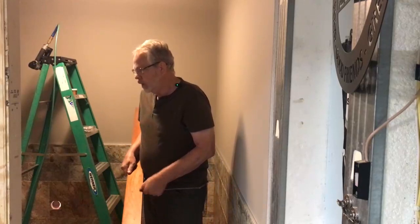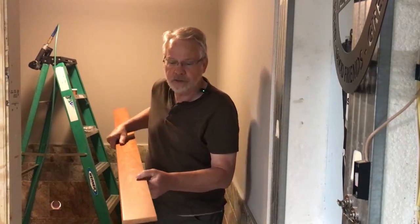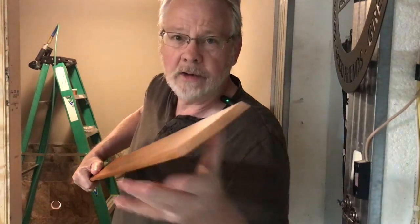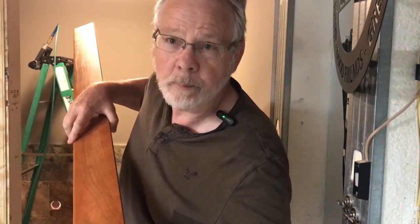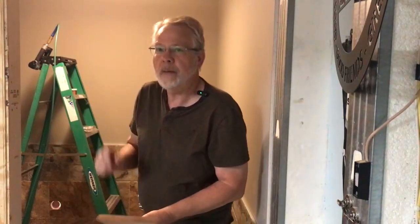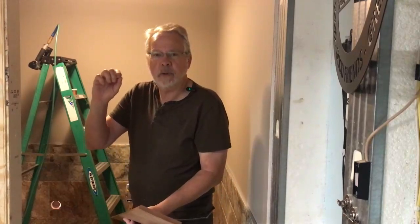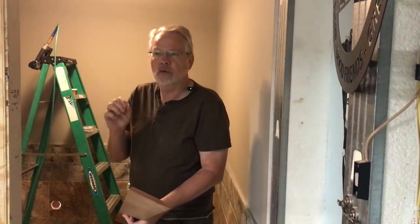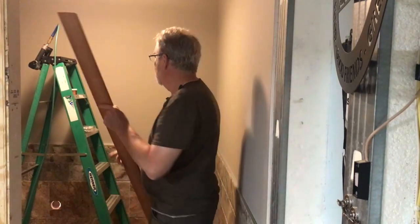So it's one of the woods that very quickly darkens versus your other hardwoods. Now, as we go to put up our crown molding, you'll notice that my saw cut is a lot lighter than the face of my board. So if I have the smallest crack in my miter cuts, it's going to be magnified by the fact that this color is different. So, a little tip.